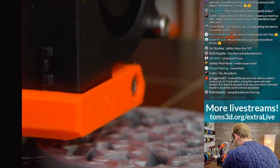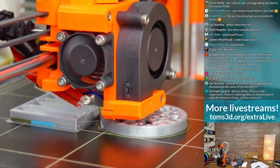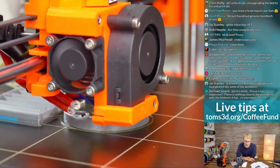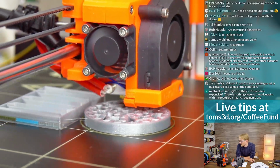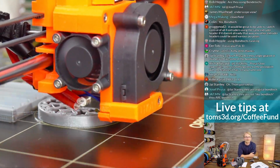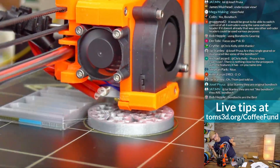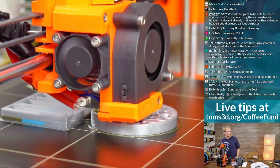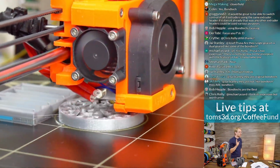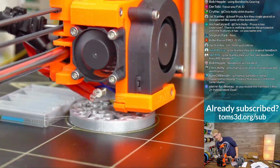So overall, the extruder is not geared down. It is a direct drive. It is a 1-to-1 gearing ratio, but it does have that dual gear drive from Bondtech. Hoping I'm not misrepresenting anything here. But it has those dual drive gears in there, which means it's just never going to slip. Other than that, regular, same Prusa i3, Prusa Research branded motors. I believe they are regular 200 step motors. The step value doesn't matter that much with the Bowden, because the Bowden is going to smooth out things anyways.